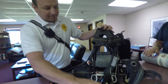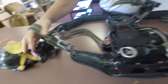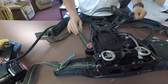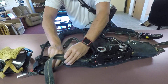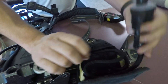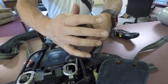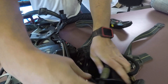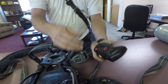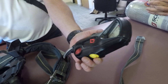This is the X3 pack. When you look at it, you've got your shoulder straps and your waist straps — just like seat belts. They buckle together and pull tight, and you pull the tab to loosen them. Inside here you've got your buddy breather — a connection on a line that you can hook up to each other's packs to breathe off their air cylinder to help get out. This is called your ECM, the electronic control module for the pack. It reads how much air is inside your tank and gives you indicator lights.